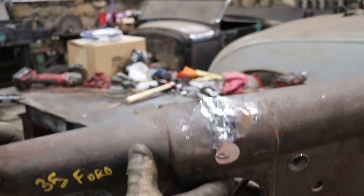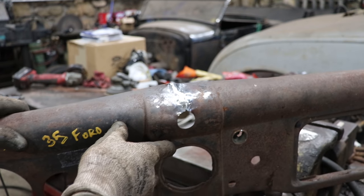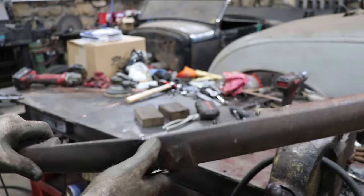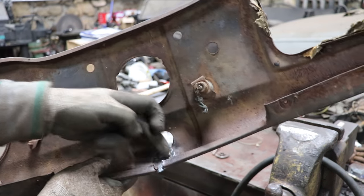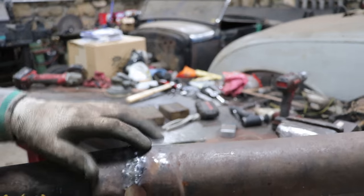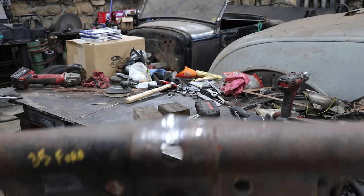So step two, again, still doesn't look very pretty, but we got the highs knocked down. There's a little low spot right here that you can't really get to because of the flange. So what I'm gonna do is get in with another tool I have and hammer with almost like a chisel in there, get that area raised up, and then we can start making it better, knock the highs down and keep going until we get it a little better.